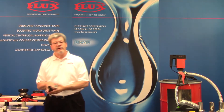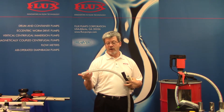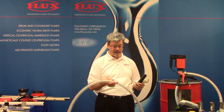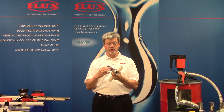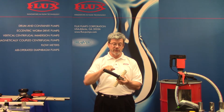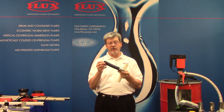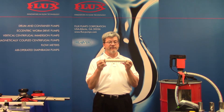Let's talk about hose for a minute. Many distributors have their own hose sources, but as a convenience we offer different hose solutions. PVC braided hose is a good choice from time to time. What we like more is hose that's totally chemically resistant — a universal hose that comes with swivel fittings. These types of hose are generally thicker and difficult to tighten down on a hose barb, so the swivel fitting helps. This hose is also conductive — very chemical resistant and conductive. The hose used in our kit is also available: PTFE-lined, conductive, and groundable.